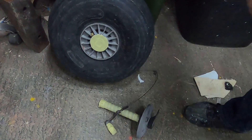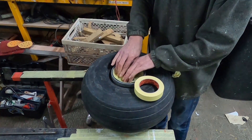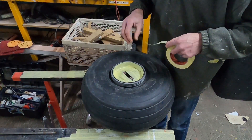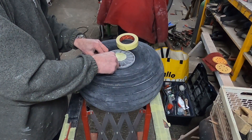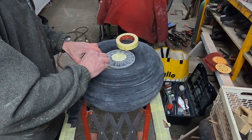After this was done, we masked all the parts of the wheel that shouldn't be painted. We especially do not want to have paint on the inside of the brake drum, even though we have the option to sandblast it again, since now we have a nice shiny machine surface. A similar thing is true for the wheel bearings — although they have dust covers, it would be a shame if some paint seeped in and made them run less smooth.